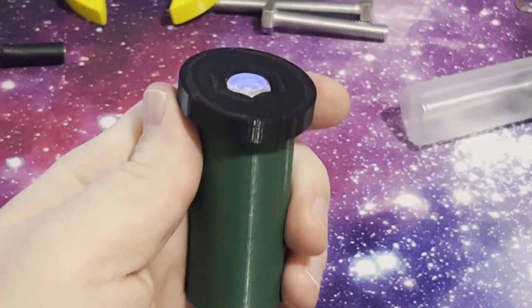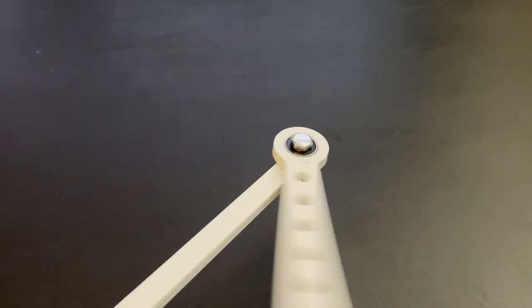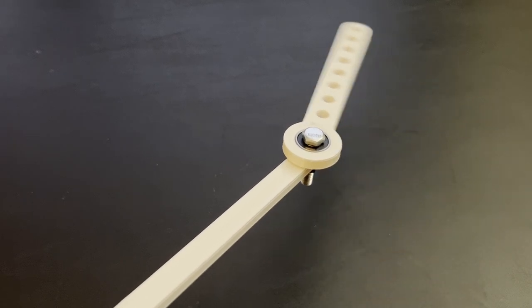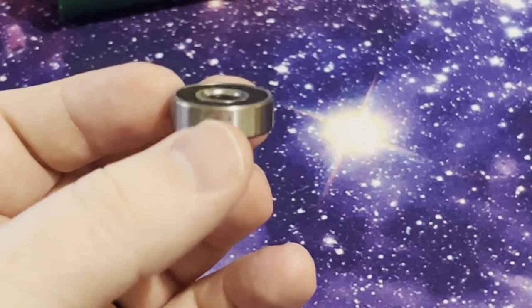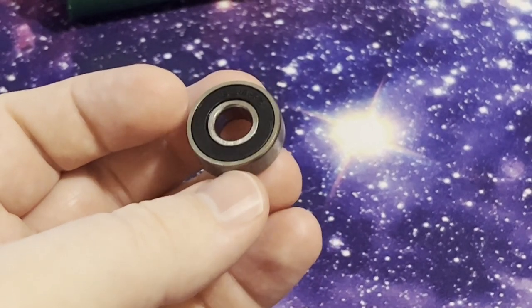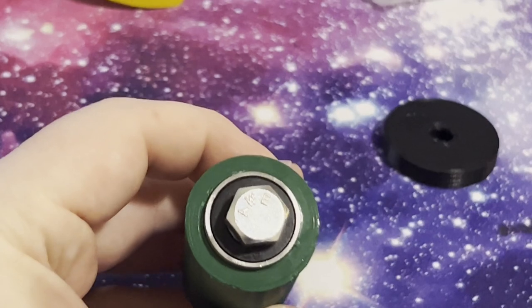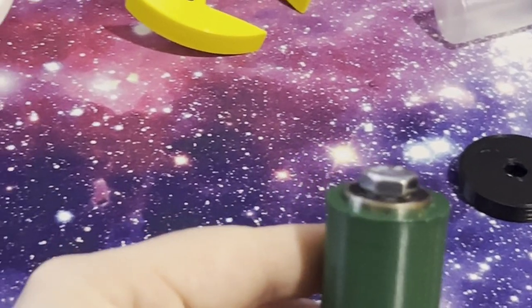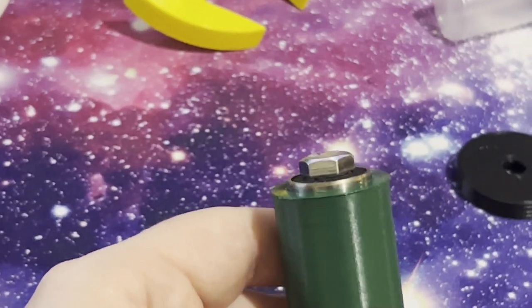There's a little consideration needed when designing a shaft. You want no contact at all between parts attached to the inner ring and those attached to the outer ring — that's kind of the whole point of a bearing. The inner ring is just barely wider than the seal, which is nice because things can sit on the inner ring without anything touching. I like to use hex bolts as my shafts. If you're using SAE, 5/16ths nuts and bolts are the largest you can get that will still fit into the inner diameter of the bearing; otherwise, use M8 nuts and bolts.